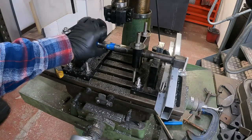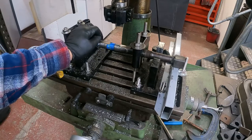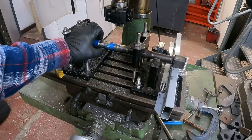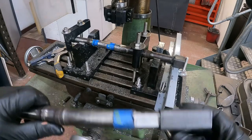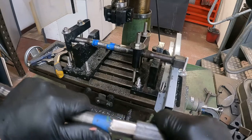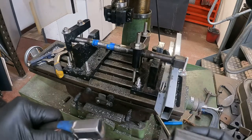23.5mm diameter original, mill one face down to 21.5, flip it over, mill the other face to a thickness down to 19.5mm, which is the inner diameter of the square joining tube I'll be using. As I say on the TV, this is what I've prepared earlier. So yeah, it's like the square drive of a socket, basically, socket set. I'll heat this tube up to expand it, and then I'll be able to slide that on quite nicely.